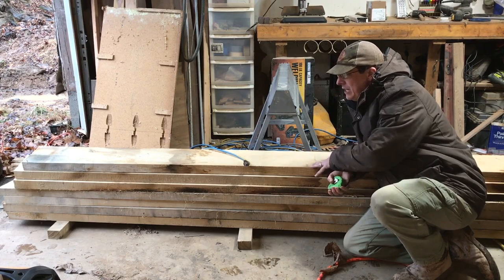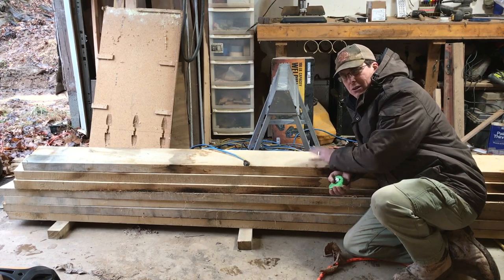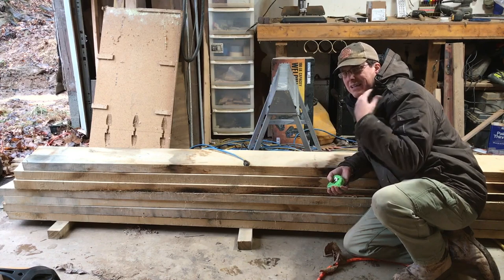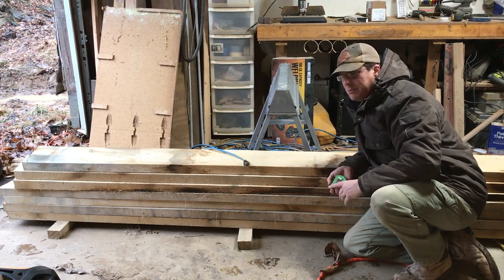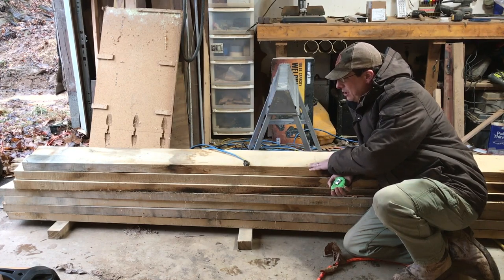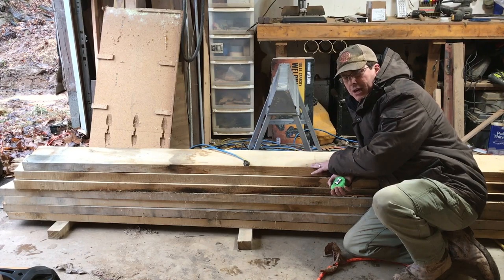I brought this wood in about 3 weeks ago and put it here in the workshop so it reduced the moisture. But humidity's a little high in my workshop, concrete floor down here in the valley. Not the craziest, I fight that all the time with my tools. But you know, getting it dried out a little bit more. If I put a moisture meter on it, probably not going to be below 20%, but definitely the point where I think most of the shrinkage is taken care of.